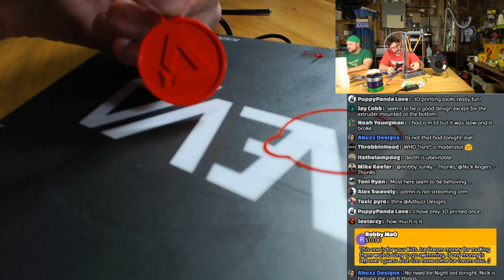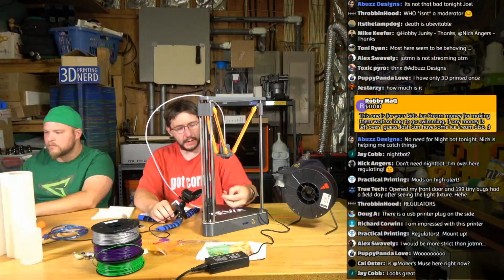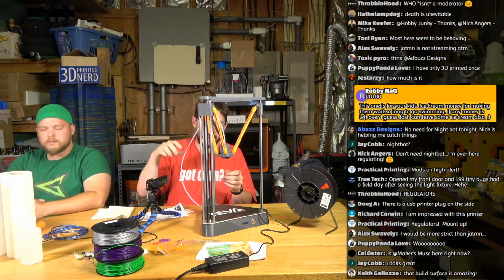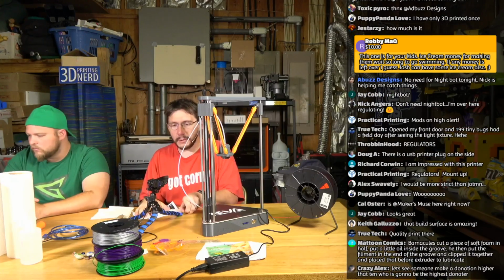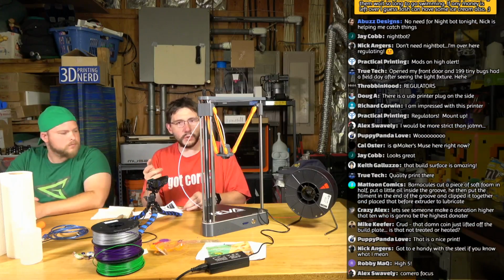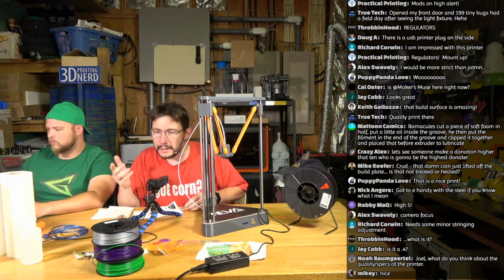It's done. Print quality's good. Go ahead and go back to the big image there, Josh. Okay, so here's where it stands. We got the Dagoma out of the box. We were able to follow very quick instructions. We were able to ascertain that the binding in the Bowden tube was the reason for the clicking. And the binding in the Bowden tube was either because of the inner diameter of the Bowden tube or because of the outer diameter or outer texture of the filament rolls from, what are they, Chromatic.